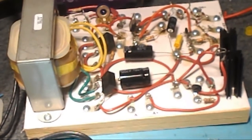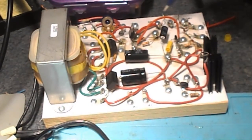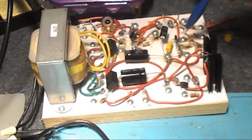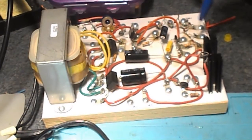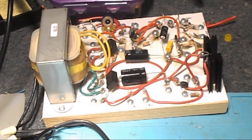And it's a bigger shot of it. But yeah, the hardest part putting these things together is getting all these diodes, making sure it's anode to cathode all the way around, so that you get those lined up right. If you don't get those lined up right, your voltages are going to be off. Not to mention you're not going to be able to see much DC volts there either. So that's pretty much worked out pretty well. So anyway, there you are. It does work. Every single one works. So it's the way it's supposed to be.